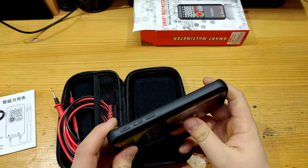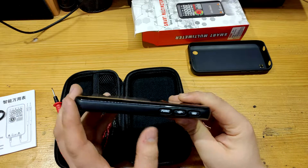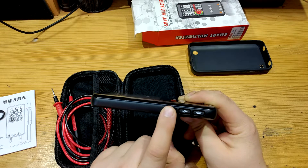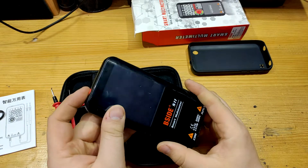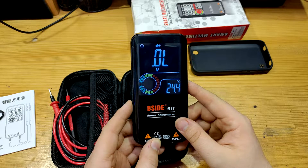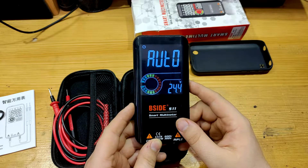What's really bad is the fact that one can't use the multimeter and charge it at the same time as it turns off. Control buttons are on the left side. We will see them better if we take it out of its rubber protective case. The controls are overall badly designed. The top FUNS button serves for all functions switching. It switches between DCV, ACV, Diodes, NCV, Live, and Hertzometer, then switches back to automatic.